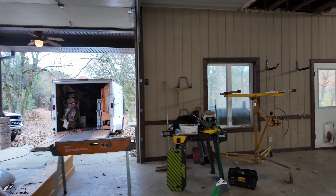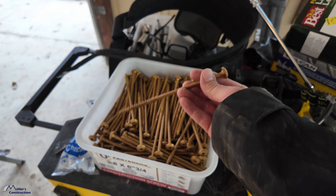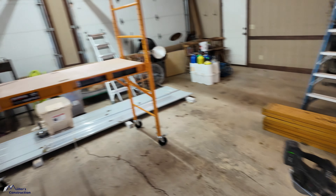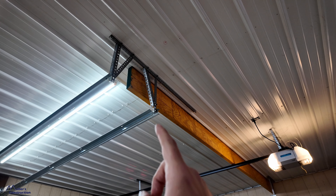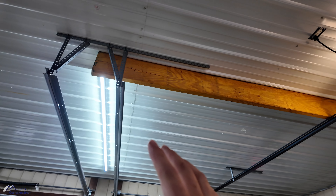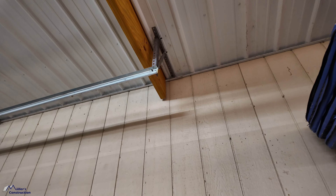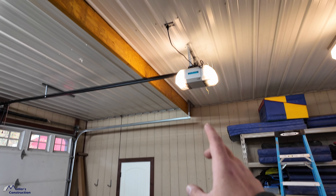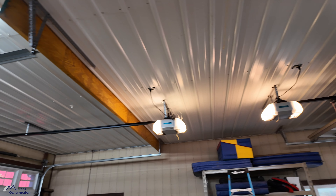You've got one ply where it goes. Let me show you real quick how that's holding up there. We're using these U2 Fastener Structural Construction Screws — they're six and three-quarter inches long, three-eighths thick, really nice screws. Basically what we did was we took a long drill bit and drilled right through the center on each end before we placed the beam. Then one guy on each end held it in place while I went into the attic and screwed right through the bottom cord of the truss. That's just holding it there temporarily — this is going to keep us nice and straight for when we set our posts. We've already checked this steel with the laser and it's really straight. And the engineer said no problem putting the beam right up against the steel on the bottom side.